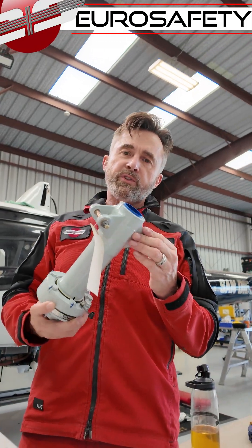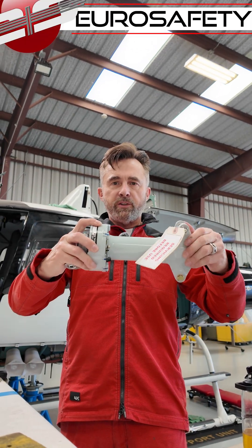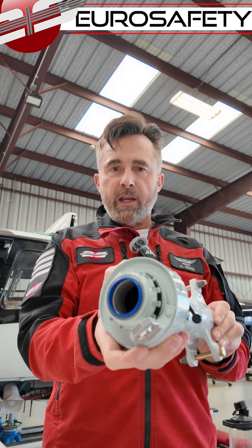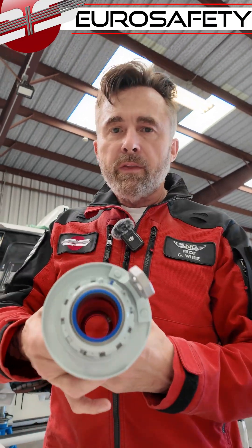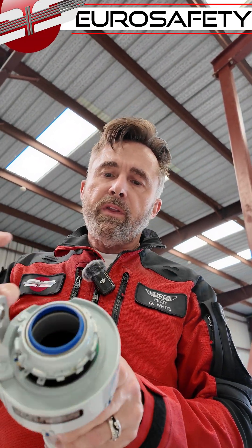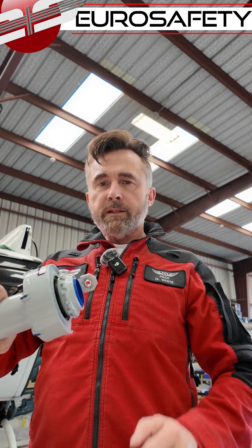We have a new spider assembly here. We have our rotating spider that spans inside of our non-rotating — you can see that's straight through there. On this side, we have a safety wire and then one of the tangs bent down here on that locking nut.